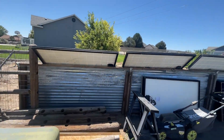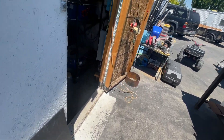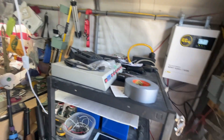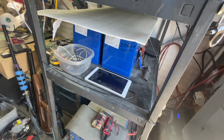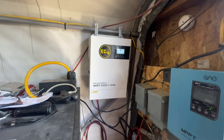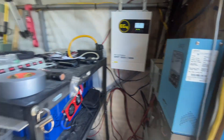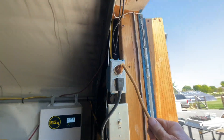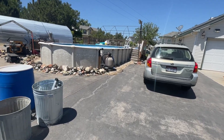This whole gizmo in the shop is a point-of-use — it's the shop's power. It's not run through the house or anything, just run for the shop. We have our power — dual fans blowing full blast. I got basically 680 amp-hours for the battery: two 200s down there and one 280 here — 400 amp-hours plus 280 is 680. I'm running this charge controller for the panels on the roof, and then that one for the ones on the fence because it's a higher voltage — 364 volts right now. This guy can only handle 150, so I couldn't do it through that one. This can only handle 60 amps also, and I'm pushing more than 60 amps now. Even with all this stuff on, and this guy's plugged into the pool, with the pool running it stays fully charged all day long. It has a lot of power — I can run even more stuff off the shop.